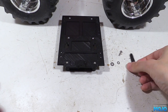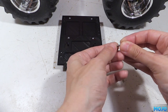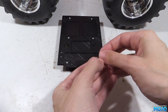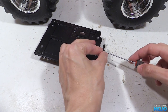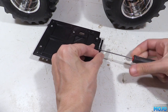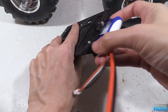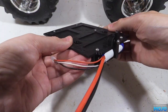To stop the battery falling out we have a little lever that just swings down. To attach it we use another M3 screw — the length isn't critical — and we also use a pair of washers. A nice one with a large outside diameter is good for going between the lever and the mount, but a bog standard one will work just fine too. It's important not to tap the hole all the way through the mount; we need the screw to be stiff as it goes in. We need to set the tightness so the lever is stiff to move so it stays put, but not so stiff that we can't move it at all. It's not going to be the strongest battery holder ever, but this build isn't expecting to be launched off ramps at high speed — it's for cruising and bouncing around, so it's going to be plenty good enough.